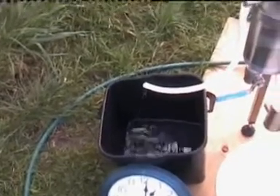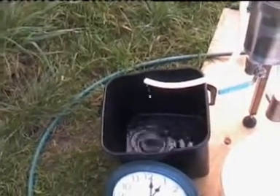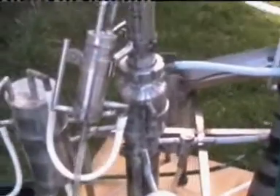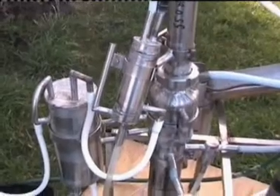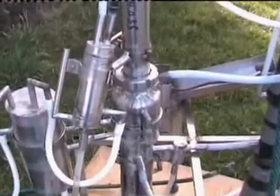Here we've got water constantly separated from the spirit. Actually, if you're conscious about water use, you can reuse this water — it could be reused for the next fermentation. And the waste mash coming out could also be used for next fermentation if collected. So all water and waste could be reused again in this system, even water used for the cooling system — it could be reused again if run through some kind of radiator, even an air-cooled radiator through a second pump. So there's actually no waste at all.